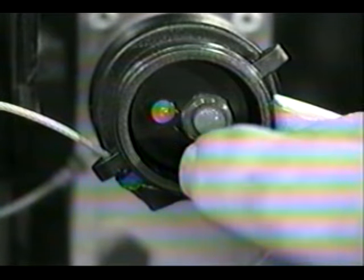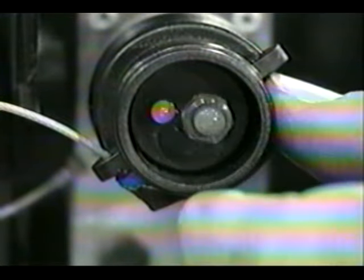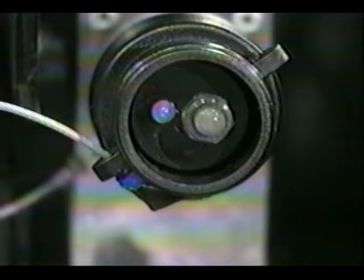Following the repair, perform the clear-all procedure to erase all fault codes from memory. It looks like there are no more active codes in the system, so you may perform the function inspections and return the trailer to service. We'll explain the function inspections later.